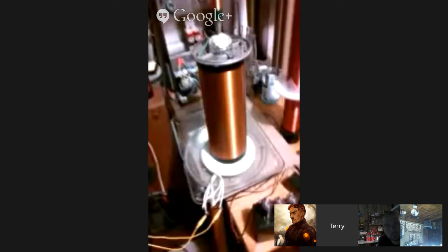I added top load to the receiver tower in the form of heavy gauge wire. I'm not sure what it is, maybe 16 or 18 gauge, and it's a half-inch PVC tube. Well, it's half-inch inner diameter, so the outer, I guess it's 3/4. Of course it's on top of this one, and then it's on top of the pancake, connected to the earth ground, which is up here.